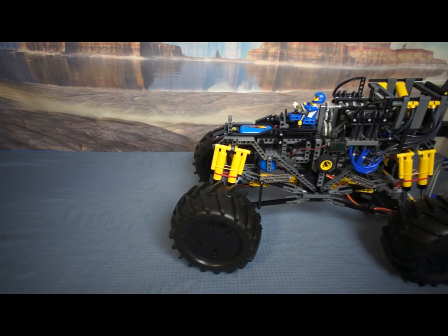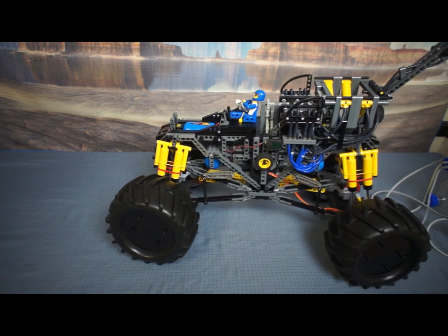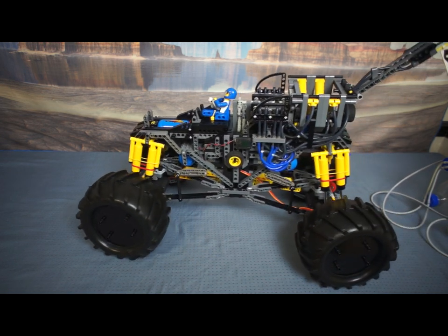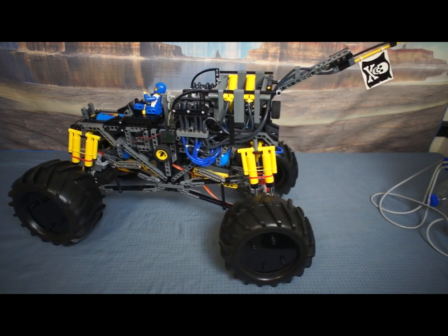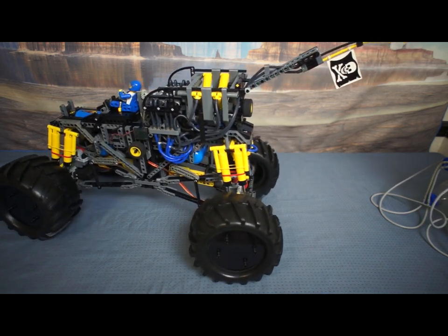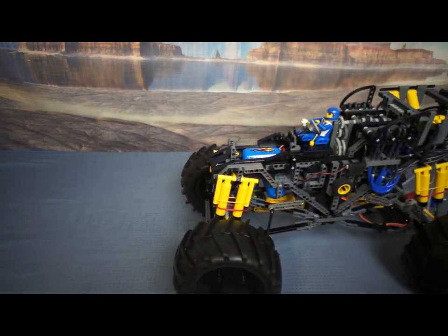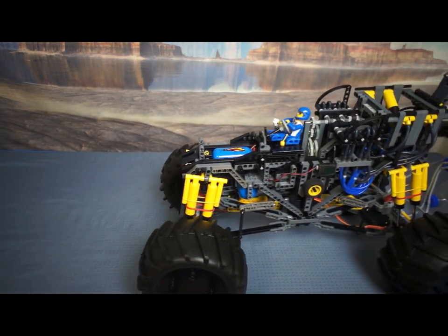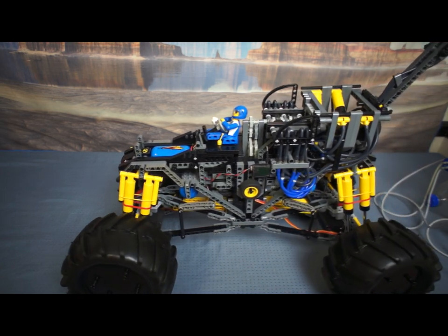The system has four blue air tanks, one for each corner of the suspension, so the air has somewhere to go when the suspension is most compressed. Here we are running again in first gear. There are two airlines supplying the engine with air pressure from the four 2-litre pop bottles at about 30 psi.